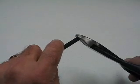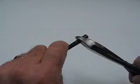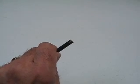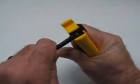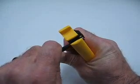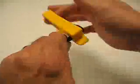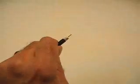First you want to make sure that the end of the cable is cut off squarely. Get rid of your excess material. Get the cable placed in the tool right up to that cable stop and hold the cable close. Rotate the tool about 3 or 4 turns and just pull off the excess pieces.